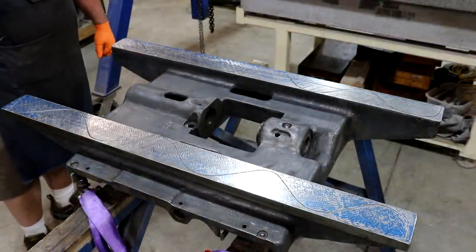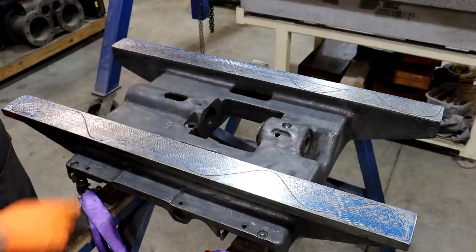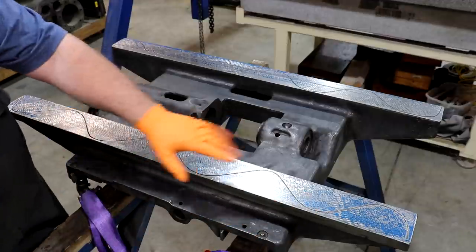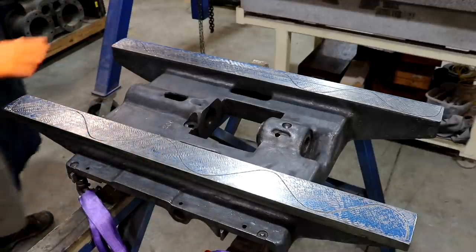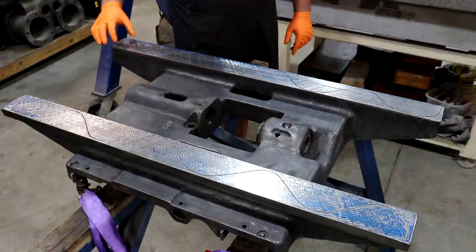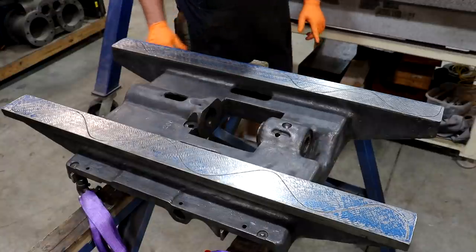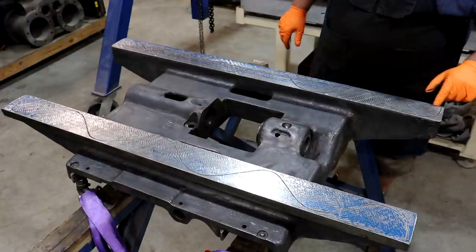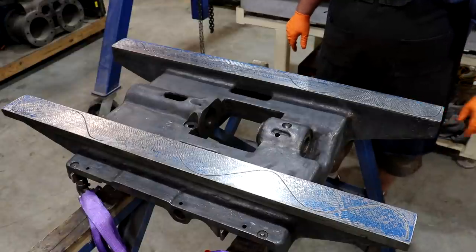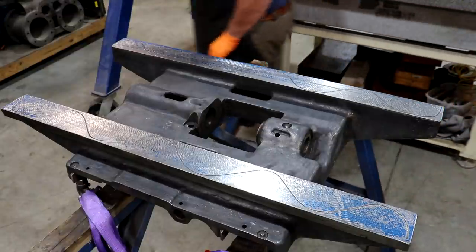That made a big difference in just that one little cycle there. We are getting really nice contact all the way up and down on this side now — still a little bit heavy on the ends and I want to pick up a little more in the middle. The backside: when we first started we just had about a half-inch strip down the back that was touching; we're now probably three-quarters of the way across. We're still not quite touching on the very inside, and still a little bit light down here on one end. So we're just going to continue bringing things down.